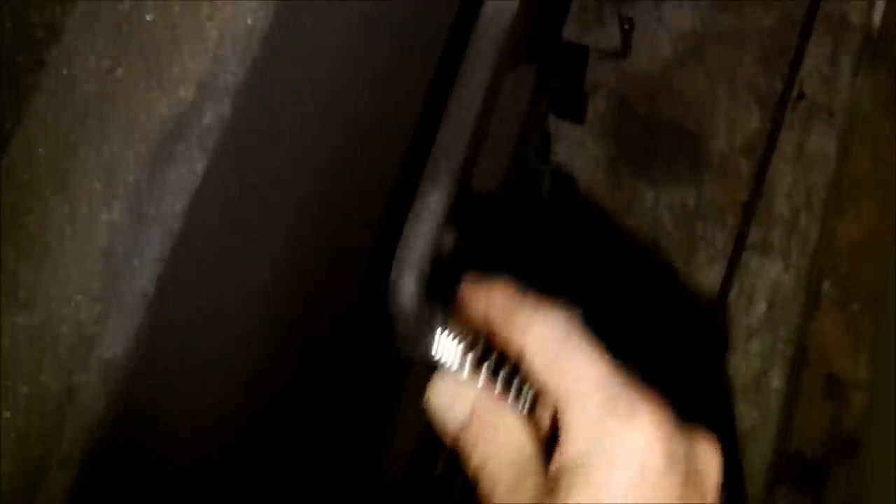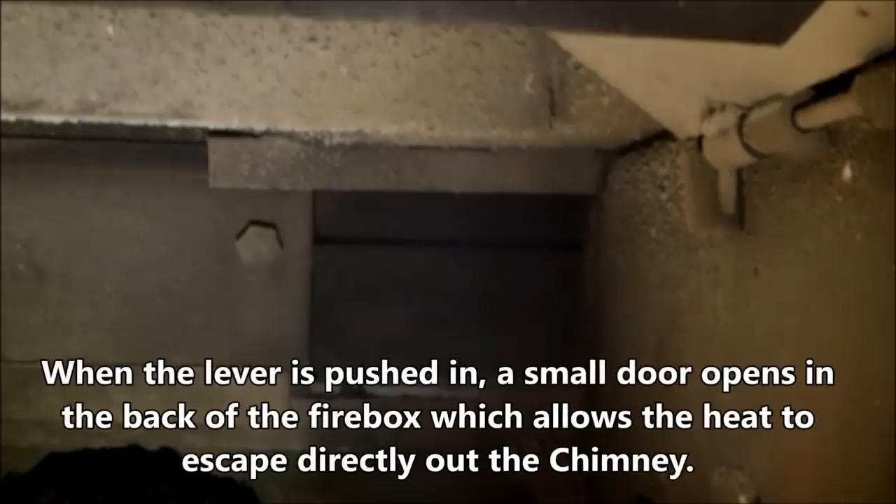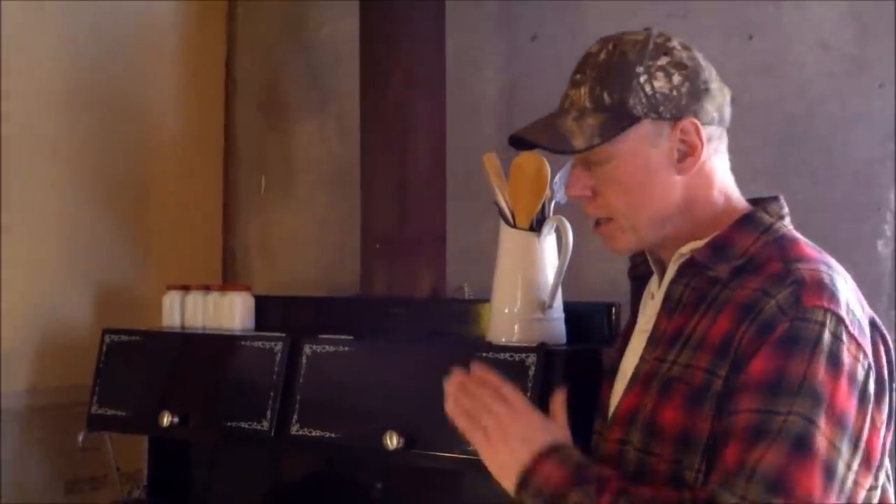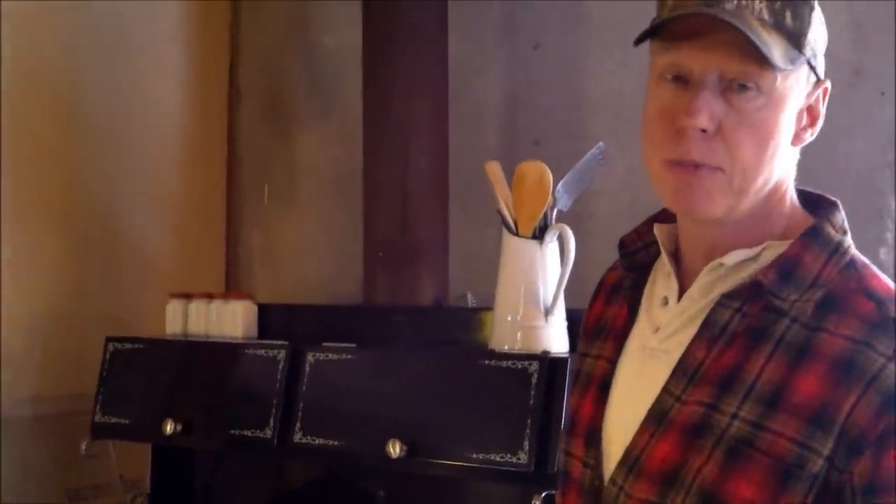Back here is another lever. When the lever is pushed in, a small door opens in the back of the firebox which allows the heat to escape directly out the chimney. Pulling that lever changes the pathway that the heat will follow before it exits out the chimney — it keeps the heat in the stove much longer, which makes it a much more efficient heater. The only time I have that lever in the pushed position is when I'm kindling or tending my fire, because opening the firebox door with that lever pulled will often get a lot more smoke in your room. Once my fire is kindled and stable, I pull that lever to keep the heat in the stove.